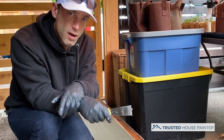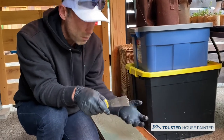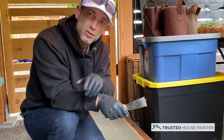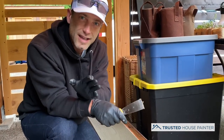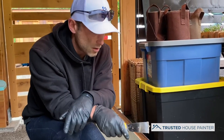Remember, you can paint cedar, but when you paint cedar with the wrong primer this is what happens — it bubbles in the heat of the sun. Cedar loves stains, solid stains. If you can stick to solid stains you should. If you want to paint it, use a long oil primer and then you can put your acrylic latex on it.